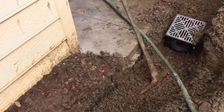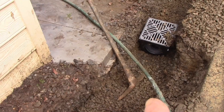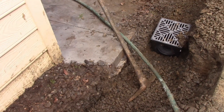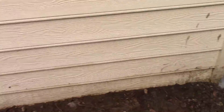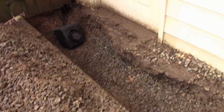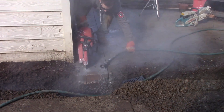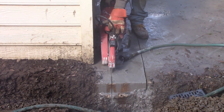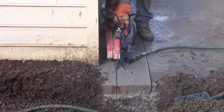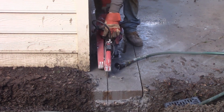Over here where we're running the concrete saw, we're going to make the second cut, break that concrete out. The line will turn and go all the way across that patio. Another catch basin, lots of gravel, lots of perforated pipe. When running your concrete saw, very important — always add water. There's actually a fitting on the saw to put water directly onto the blade, but we find it a lot easier to just lay your garden hose out on the side. Keep that blade cool, it keeps the dust down, and it cuts much better.